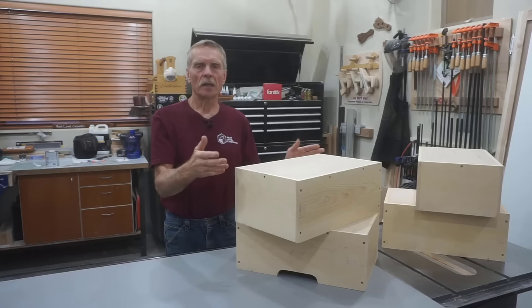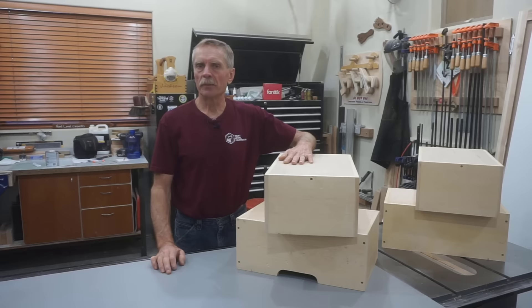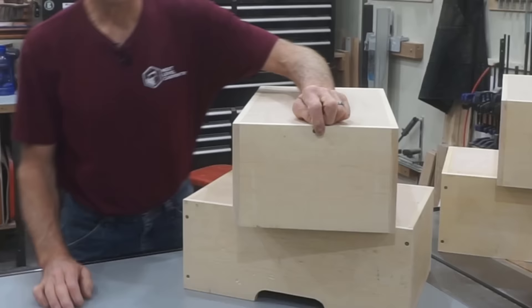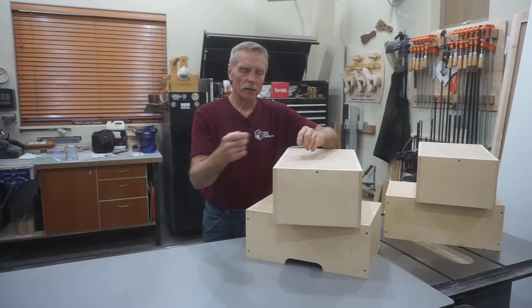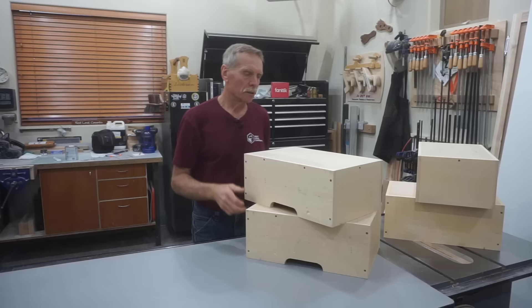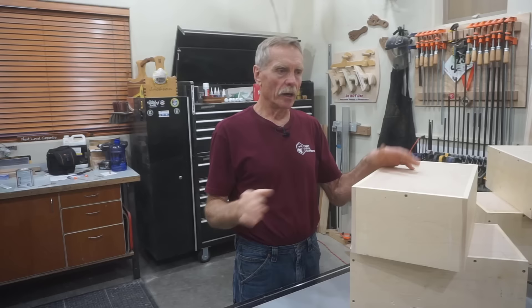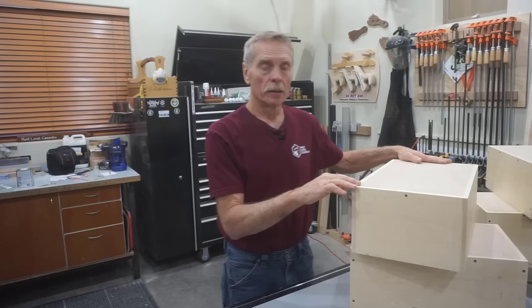The first property is that surfaces need to be clean and smooth. Flat surfaces need to be flat. And most important, there can't be any voids underneath the laminate. I've got screw holes from assembly — the laminate will bridge those — but if anything sharp hits the laminate over a recessed screw head, it'll puncture through like an eggshell. All corners and edges need to be very square. You can bend laminate on a curved surface, but where there's a 90-degree corner, it needs to be exactly 90 degrees or it'll get spoiled during trimming.